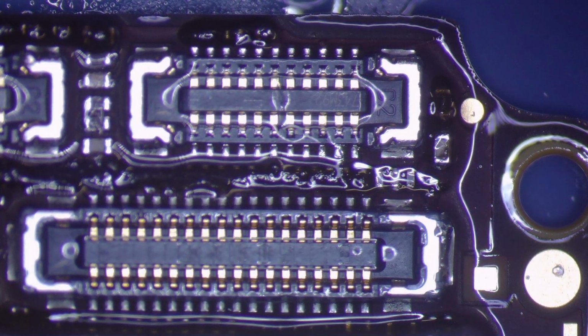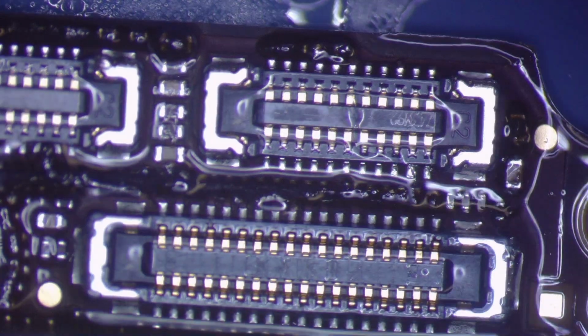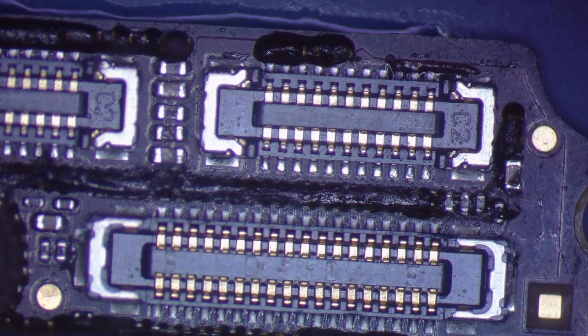So if the fuse is getting hot, what does that tell us? Is it that the fuse is bad? No. We tested the fuse. The fuse is good. That means that the short is not on the 3 capacitors that we talked about, or was hoping that it was for. That means it's going to be on the other side of that fuse.